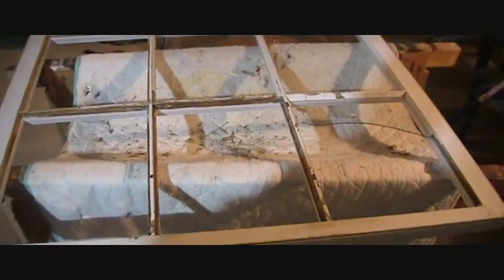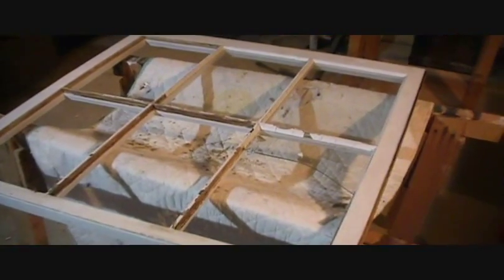So here's what happens if you're a little too rough on the glass when you're trying to take the glazing out. I managed to get the first three windows out without breaking any, but this one I did break. So I'm going to have to replace it, but remember that the old glass is going to be a little more breakable than newer glass, so you do have to be really careful. I will also note that the inner mullions here, you have to be pretty careful with those as well, because once you start taking the glass out and the glazing, they may appear a little bit weaker, because the glazing and the glass actually do support the window and help to make it stronger. So just be careful, and looks like I'm going to have to get at least one more piece of glass.